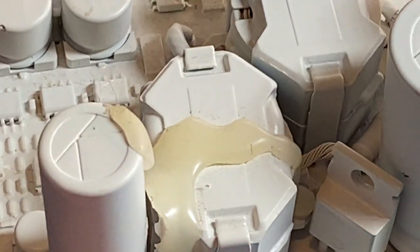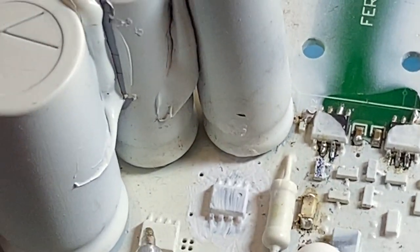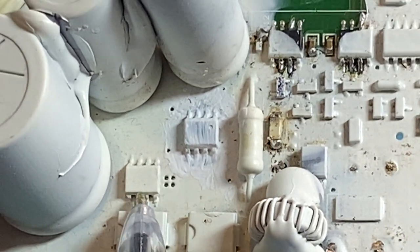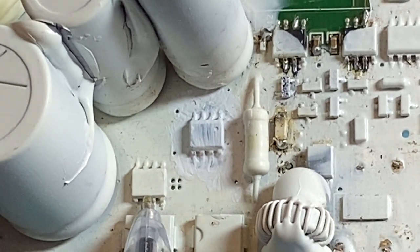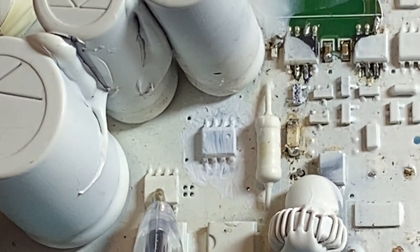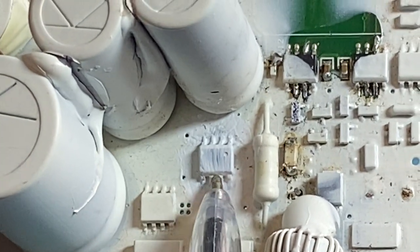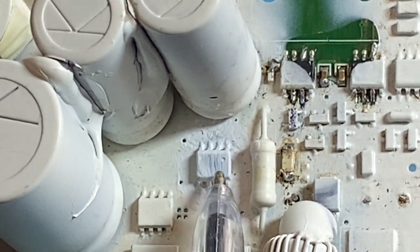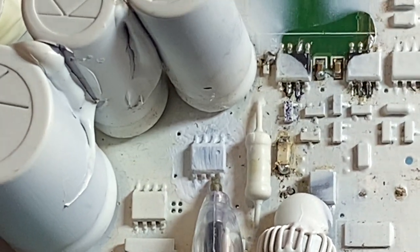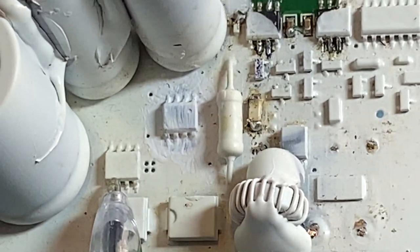That's another thing. Okay, so you have your flyback pulse generated by this one here. This one here does, for memory, it does a long pulse. That is, yes, it is an N-channel MOSFET. And so is that one that does the small pulses, the 15-volt pulses. So this one here is actually a high-power version of that one.